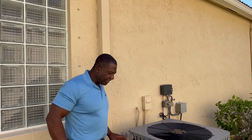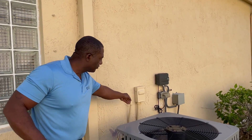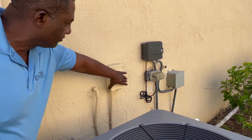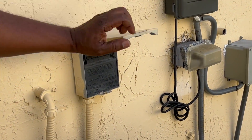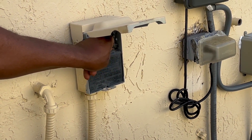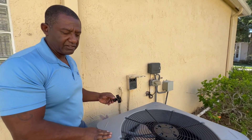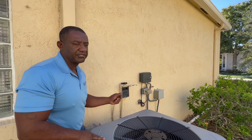Now I've turned off the unit. To make my installation, follow all the safety requirements — turn off the power. I'm going to go inside and turn off the two breakers for the inside unit and outside unit. Outside, there's also a disconnect for the unit on residential homes, that's a requirement by code. All you do is pull this out and now you've killed the power to the outside unit. But as an extra precaution, I'm also going to turn off the breakers inside the house.